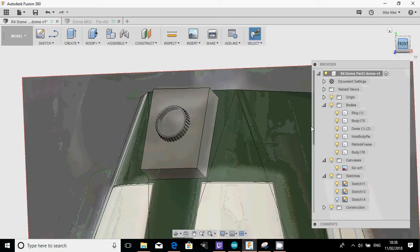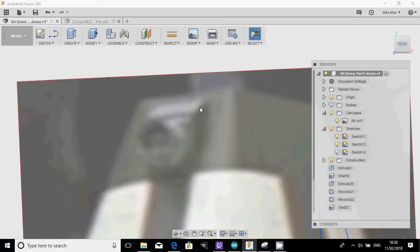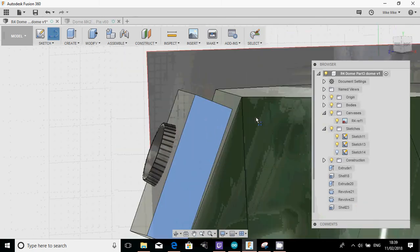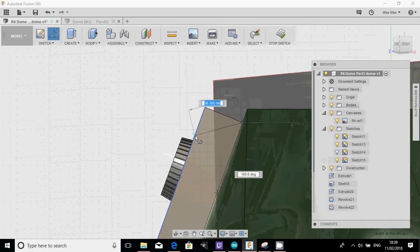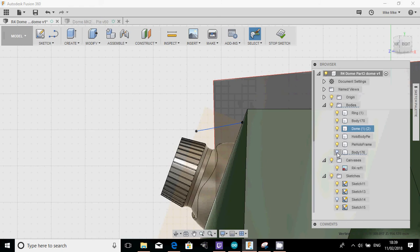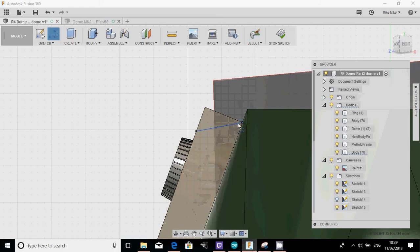Interestingly, if you look at the reference picture, that's at quite an angle coming down. So the next thing I'm going to do is draw a line on here. And what I want to do now is cut that cowl in to go somewhere like that. Okay. Now what I will do while I'm here is check, if I cut that, that there's still enough gap to support that holo projector, which there seems to be. I think that angle's a little bit shallow, so I'm going to take it a little bit deeper.